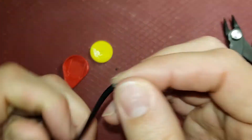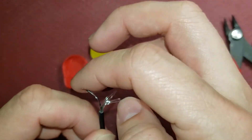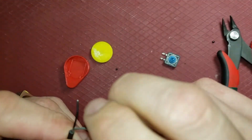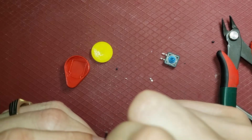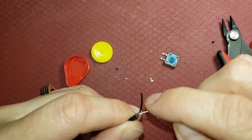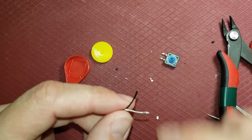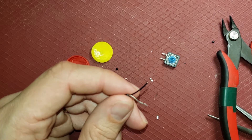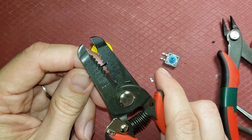You're going to have these braids here — I'm going to twist and thread these together. So I have those two bits, and then I'm going to strip about half of this. What you don't want is this piece and that part of the wire to touch, as that'll complete the switch, making your button irrelevant. This looks a little bit thinner here, so let's try the 24 gauge.